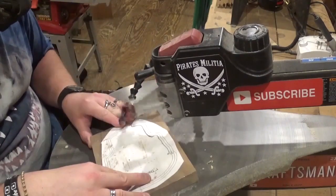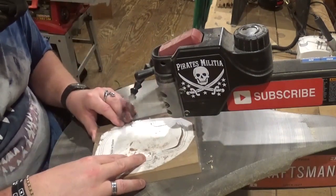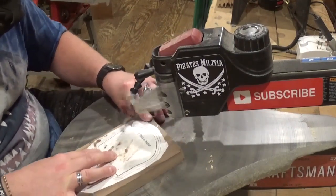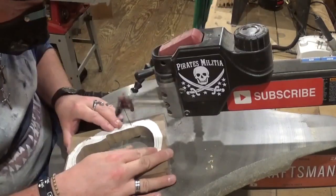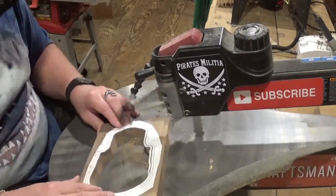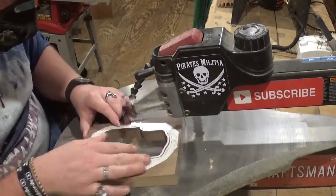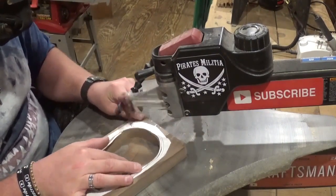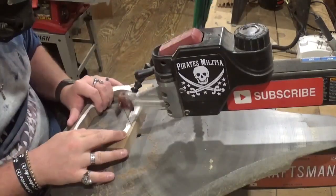It's critical that you stay as loyal as you can to the cut line here, because these two pieces have to line up and make the walls of the box. I'm using the same number five blade because if you use a thicker blade it will take more material out with the kerf and make the walls that much more fragile. If you'd like to try this pattern, it is available as a free pattern download over at Steve Good's Scroll Saw Workshop blog spot in his free pattern catalog.